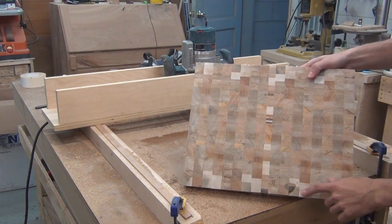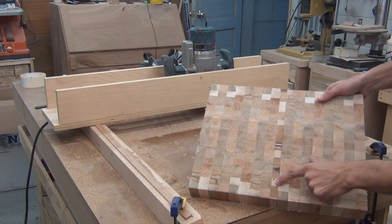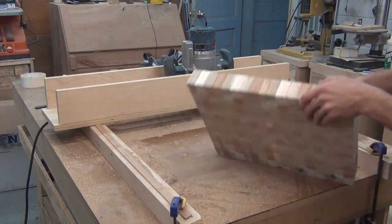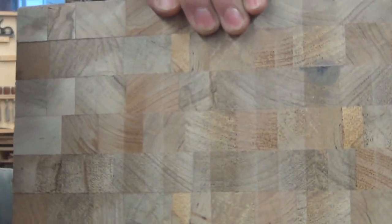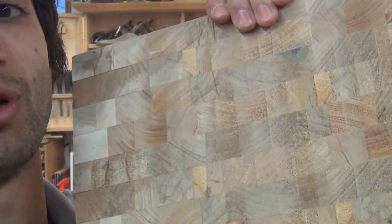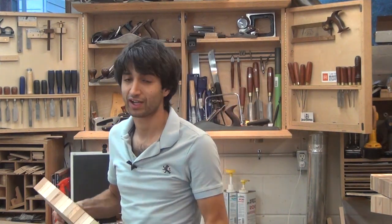Alright, so there's a little bit left here — I need to go a little bit deeper, but overall that's pretty good. It didn't really take a whole lot of time, and you can take a look at the surface quality. There is a fair amount of tear-out, and this would need to be sanded again before finishing. But even if you just put this through the drum sander or sand it by hand, this obviously saves you a lot of time as far as flattening is concerned. So I think for sure this is my go-to method in the future for all of my cutting board flattening needs. The only downside is it's really messy.